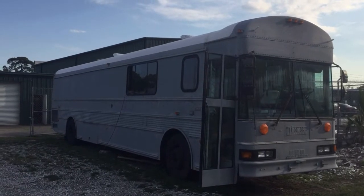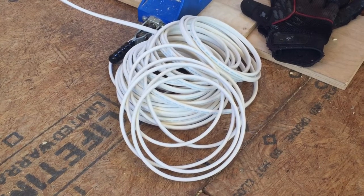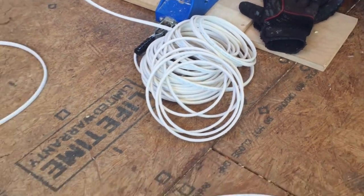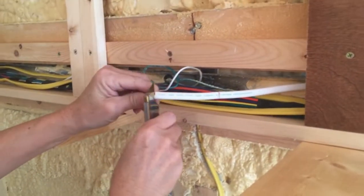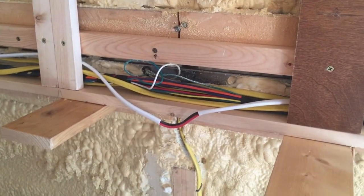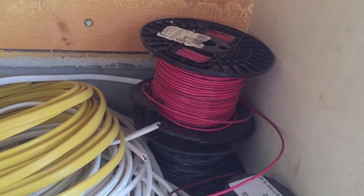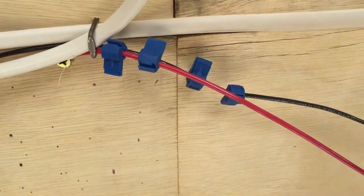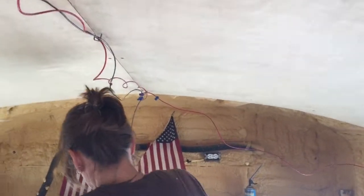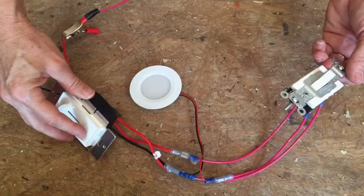The humans began this project by purchasing two separate kinds of 12-volt wires. The first was a large roll of 14-gauge insulated marine wire. This type has both the negative and positive wires protected inside insulated sheathing. The second type was separate spools of 14-gauge negative and positive wire, sans extra sheathing. This type is easier to use for fixtures that will be run in parallel or series that need to be tapped several times, like a string of puck lights.